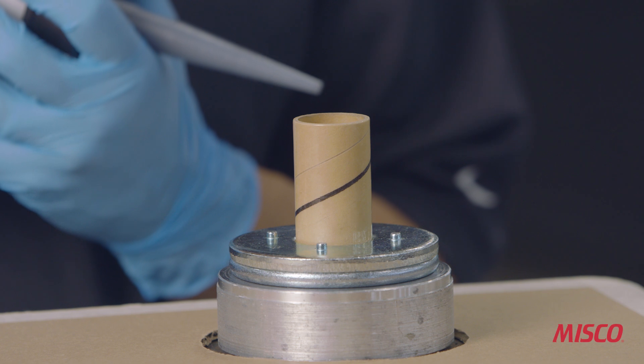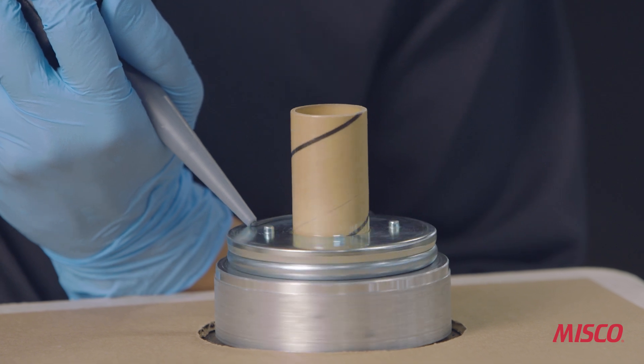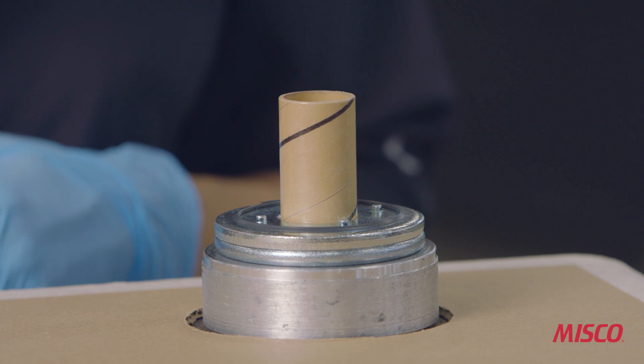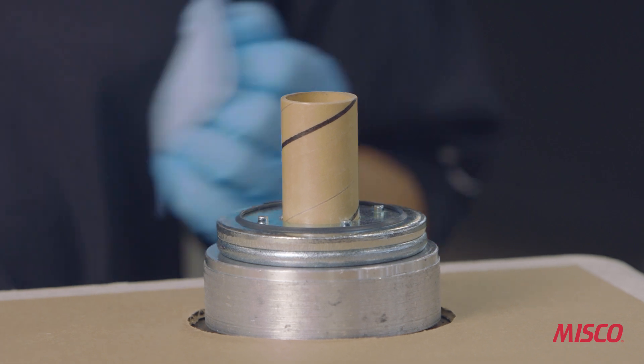In this operation, we're going to apply a silicone gasketing adhesive to the front plate of the speaker. This adhesive is used not so much to bond the front plate to the basket as it is to prevent metal to metal vibrations between the plate and the basket.